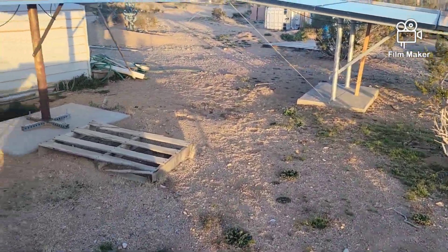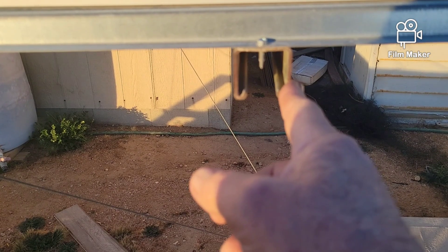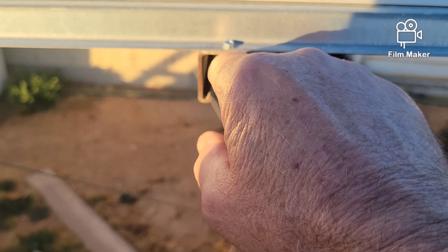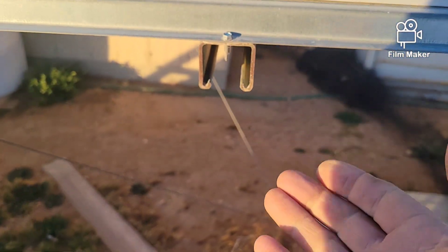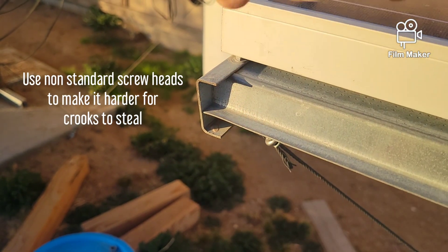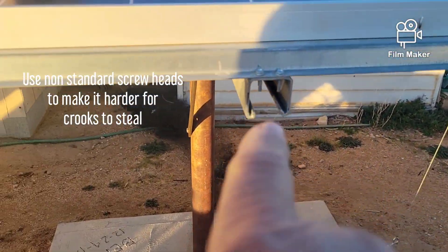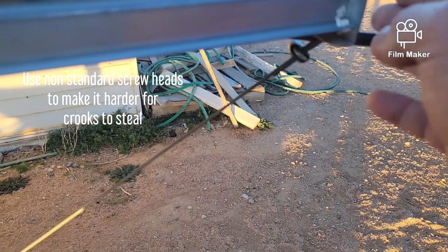With those hat pieces and the channels, you also use unistrut — you can see it over here. The unistrut is in the electrical department. You can see where I shot the screw right through the furring strip and into the unistrut — it holds it together, no welding. Over here with the channels on the end, I put screws through the top going straight down through the furring strips. Here you can see two in the center, one on this side, and then the end channels.